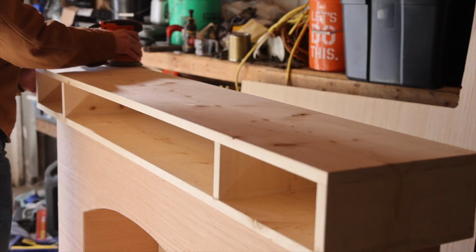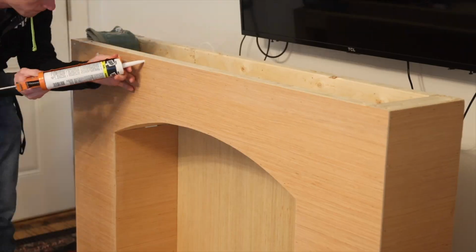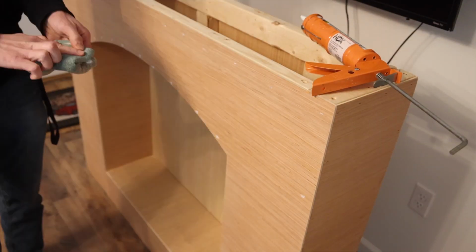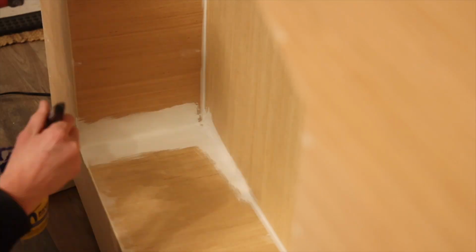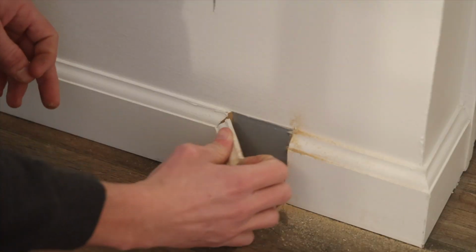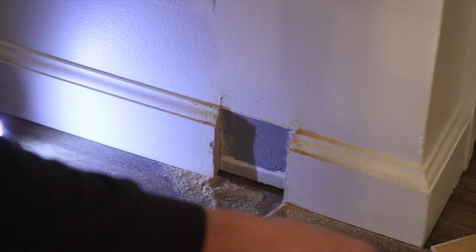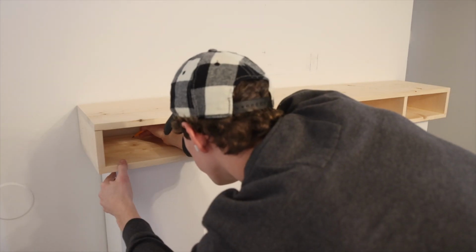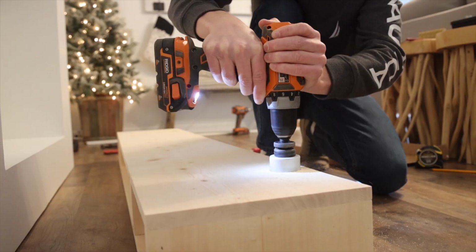After the mantle was finished drying, I did some light sanding. I took the rest of the project inside and used caulking to cover all the staple holes. This really helped smooth out everything and could almost convince you this was made of drywall. I notched out the areas of baseboard where the 2x's were going to rest against the wall. I also needed to mark and cut holes for cables.